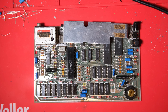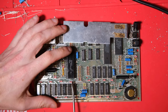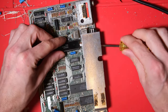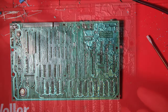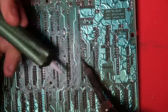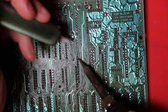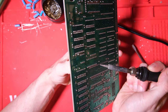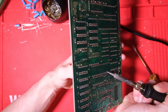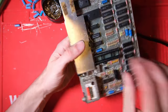Okay, lovely, that's looking great. One last important job is to put a heatsink on the ULA to try and help it live a long and happy life. This isn't essential, the process carries some risk, but if you're competent with desoldering and soldering, then there's no harm in doing it. Tempting to destructively remove the socket to speed things up, but I have pulled tracks doing that before, so I do recommend taking your time and waggling it out like this. And out it comes. Lovely.